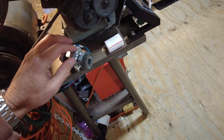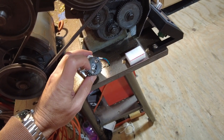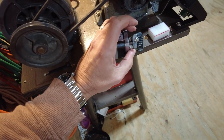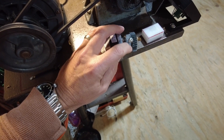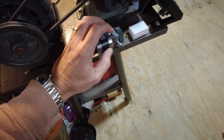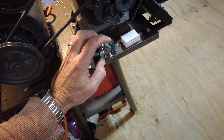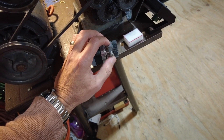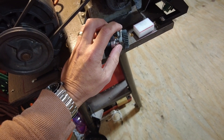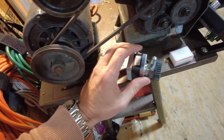The way this was built is we drilled some holes here, countersunk these bolts, and then attached it to this piece here. This was the head of a great big bolt that was kind of in the junk bin. We put this on the lathe and flattened this side, flattened the other side, and then bolted it together. As far as the screw here, I ran some taps so the screw would hold on to the shaft of the little stepper motor.